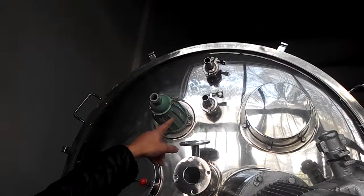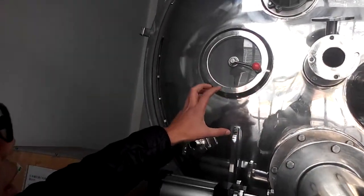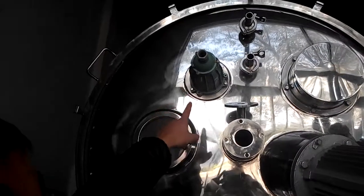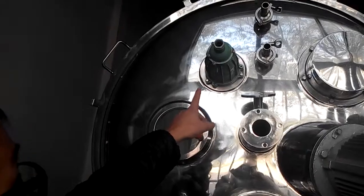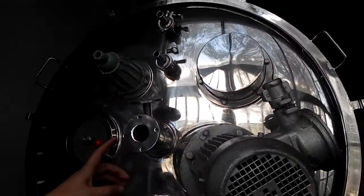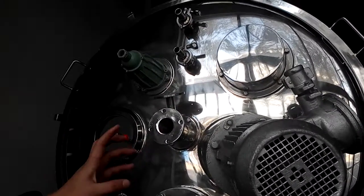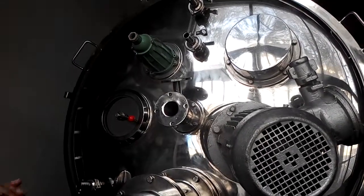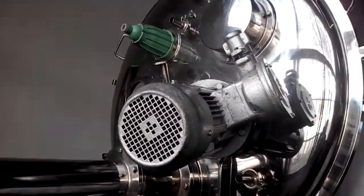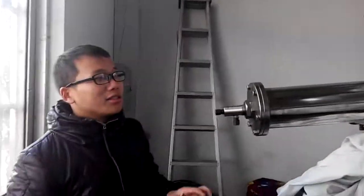That one is for cleaning. Then there are two small pipes, also for cleaning. And this is the observation glass — you can see what's happening on the inside of the centrifuge when it's working. And that one is the explosion-proof lighting, which lights up the inner side of the centrifuge. And that one is the level detector for the solid. When the solid in the centrifuge reaches a certain level, the sensor will activate and give a signal to the hydraulic scrapper to supply hydraulic oil, activate the scrapper, scrape the solid, and discharge it out.